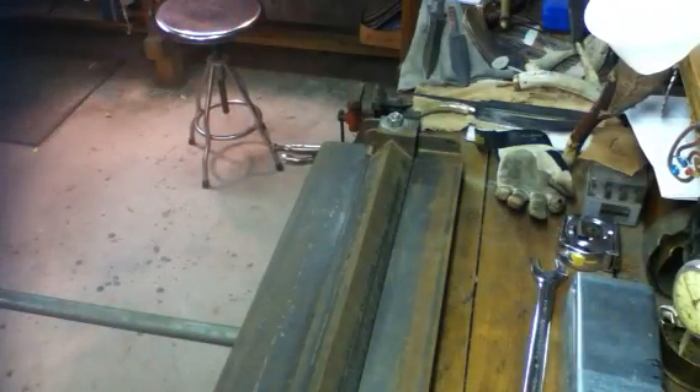What we're looking at is a piece of two-inch by quarter angle. These are five-eighth by three-inch long bolts. We're looking at a base of a six-inch piece of channel iron. This is three-inch by a quarter-inch angle, and just a standard three-quarter-inch coupling welded on. Then I just put a little weld there where I made a cut for the pivot piece.